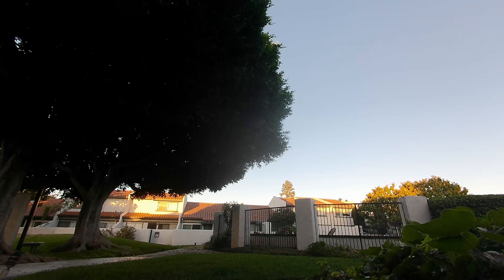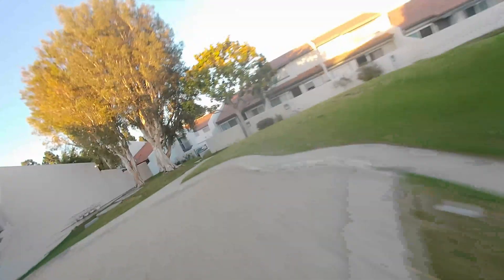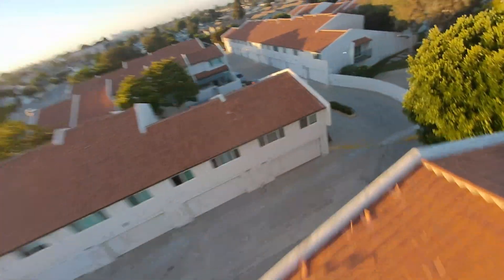Let's give it a quick test flight. The footage is coming from the RunCam Thumb Pro at 4K 30 frames per second, and I ran it through GyroFlow to stabilize it. With the upgraded F1204 motors, you can feel a significant increase in recovery power and punch compared to the original stock motors — especially when pulling up. The stock motors struggle and are mainly rated for 2S, not 3S. I think this is a worthwhile upgrade, as it makes the quad fly much better. As for the antenna, much better range compared to the stock linear antenna — you won't lose video feed during rolls or flips, which was actually happening to me before.